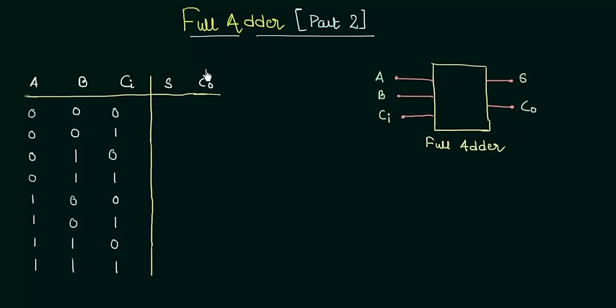In this presentation we are going to find out the logical expression for the sum and the logical expression for the output carry, so that if you want to make an adder circuit you can make it. This box is your full adder, and what is inside this box is a combination of logic gates. We are going to find the logical expression using the Karnaugh map.